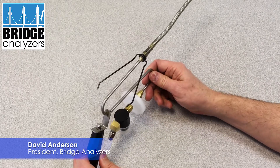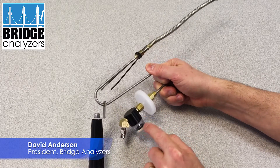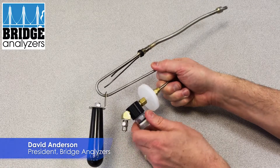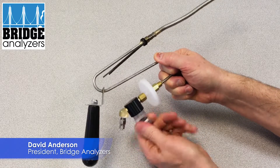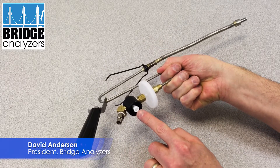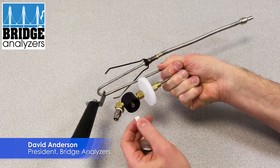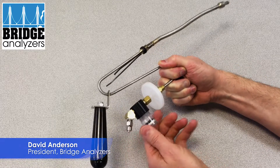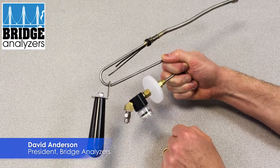You want it mounted like this when doing testing, so any water will drop down into the bowl and only gas will be drawn out. This unscrews from the manifold to relieve any water in there. This filter should also be replaced periodically — it just pulls off a barb on the manifold. Make sure it's snug; there's an o-ring seal, so it doesn't have to be tight, just finger tight.